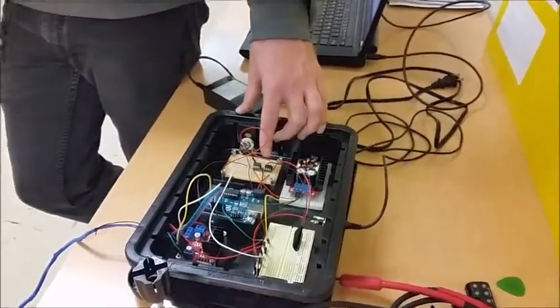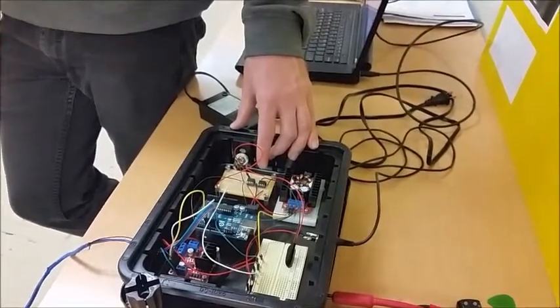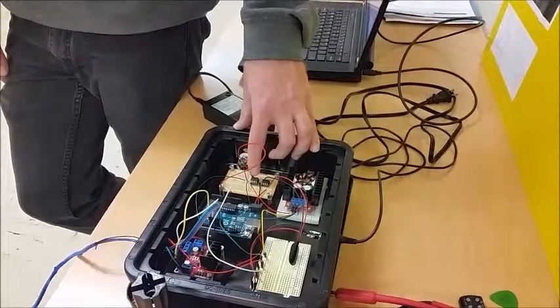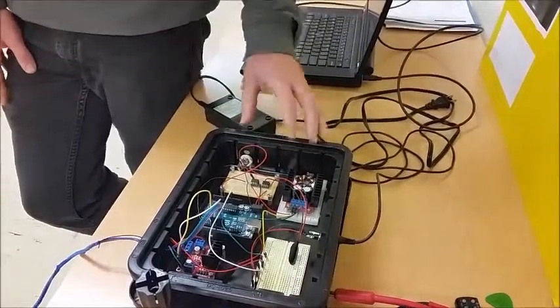This circuit took a lot of time and tinkering to get it to start dropping off frequencies low enough so they wouldn't interfere with the IC. At about 120 Hz, the filter starts cutting off, which is exactly what we needed.